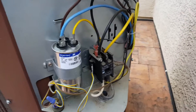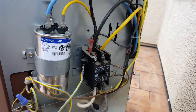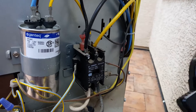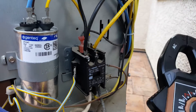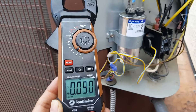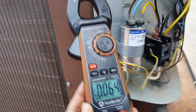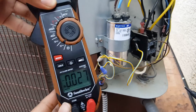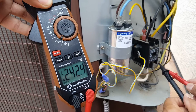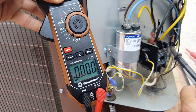Now going hands-free to show you the voltage. We've got the voltmeter set to AC. Measuring across the two main terminals — we're at 242 volts, which is good. Then measuring across the connector: we're at 242 volts as well. So there's no drop in voltage at the connector.